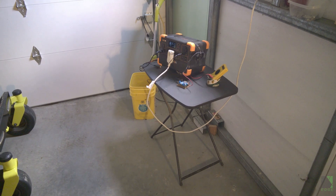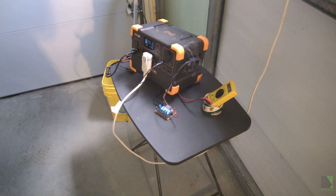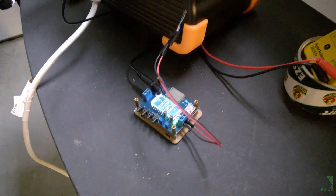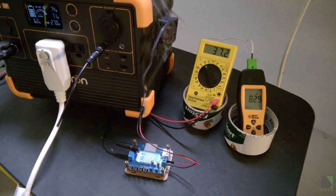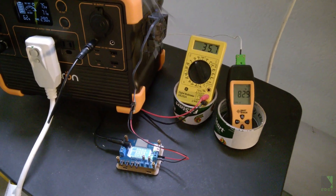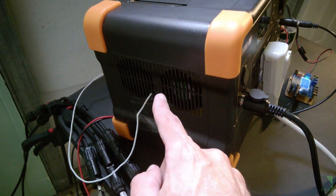After about four days of really hammering this machine it has not shown any signs of fatigue or any problem whatsoever. It's a little bit warm in my shop so I rigged up a server fan for extra cooling on the case, plugged into the DC port through a DC regulator. I'm measuring the temperature inside the case with a thermocouple — right now it's in the 80s, but earlier under heavy load it was around 100 degrees Fahrenheit inside the case.